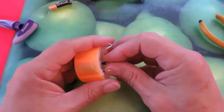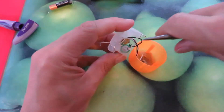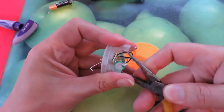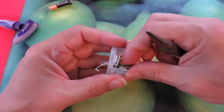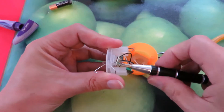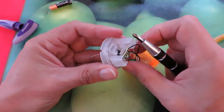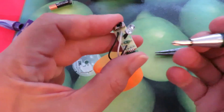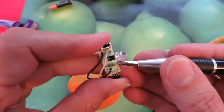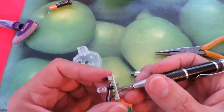This one had three screws in it which I've already taken out. That's the circuit board. There's a screw there, so I need to get the rechargeable battery out of the way to get to that screw. These bent paper clips I've put in there are not part of the original solar light. That item there, which looks like a resistor, is actually an inductor. You can either cut it out or desolder it, and then we're going to solder the electric motor onto the same two terminals.